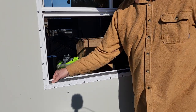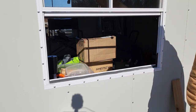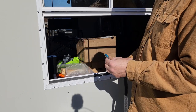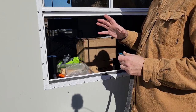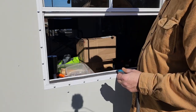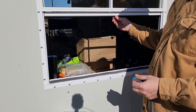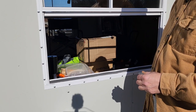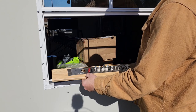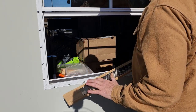Okay, so I've got the weather stripping in there. I didn't have the camera on for that, but the backing on this tape is extremely sticky, which is what you want. You want to be slow and deliberate as you're putting it in so that you get a nice seal. I did it on the sides and the bottom. I'm not going to do the top because the window itself has a little strip there — I may come back and do that later. Let's put it in and see what it looks like. We're going to do the thicker board down because of the high lip here on the window, so it doesn't interfere with the metal plate.